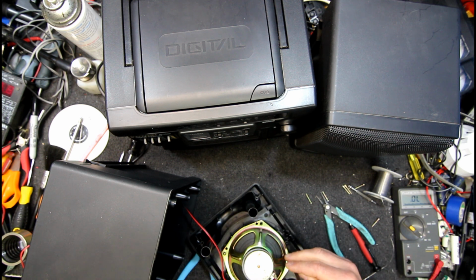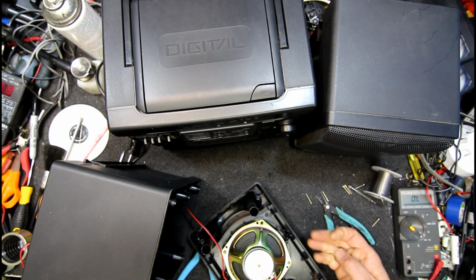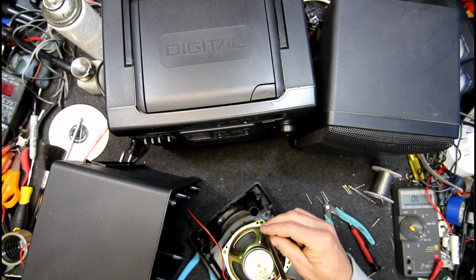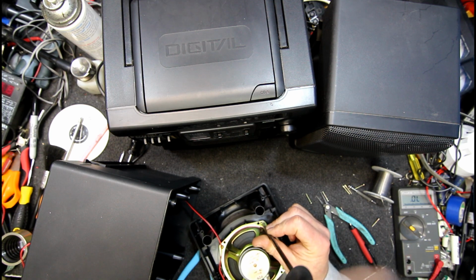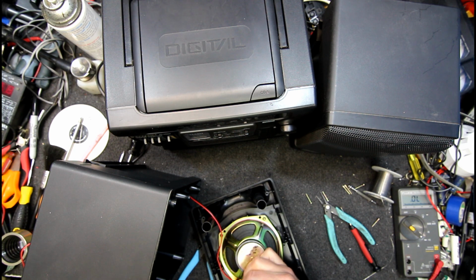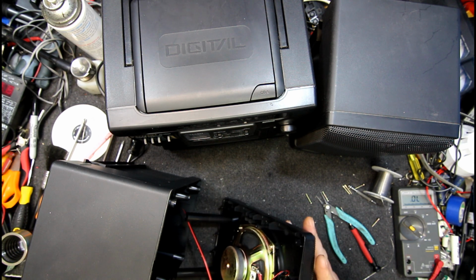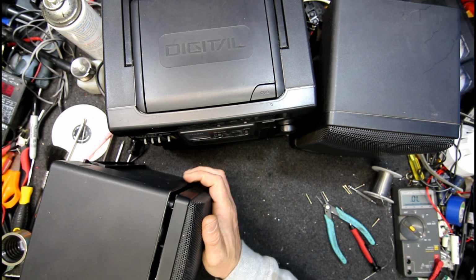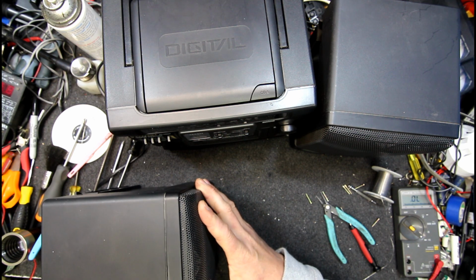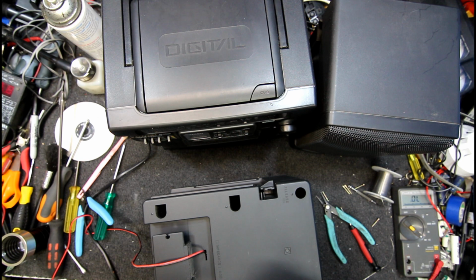Because I don't know, that wire can't have come off from me. It looked like it had a tinned end on it, like it was meant to be soldered to something, so I hadn't broken it, because it would have been too short if I had. And there wasn't a lot of solder around where the copper wire, that flexible bit from the back, came through. And a weird amount of glue around it, so I wonder if the thing never got soldered in properly and someone, or the machine or whatever, put a blob of glue over it, and it could have gone for years before it finally played up, who knows. Maybe it just played up as soon as I got hold of it.